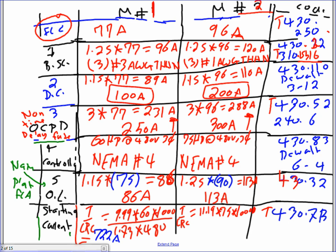That result is in rush amps. That's all five things including the starting current for this motor. Now we need to find a few things for the feeder. For the feeder overcurrent device, the NEC code says take the largest fuse in your system, add to it the full load current of the other motors. You end up with 377 — and you have to go down to 350A. The trickiest thing is people go up. We go up on the branch circuit, down on the feeder overcurrent device.